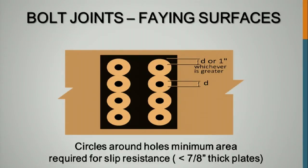Would that steel eventually be malleable so they would come closer together? It can't come together. When you get a 5-inch plate, it's not going to flex. It's like, if you hold your hands like this, you can't get your fingers in total contact in this area. There's going to be a gap because it's out of flatness. There's an out of flatness tolerance.